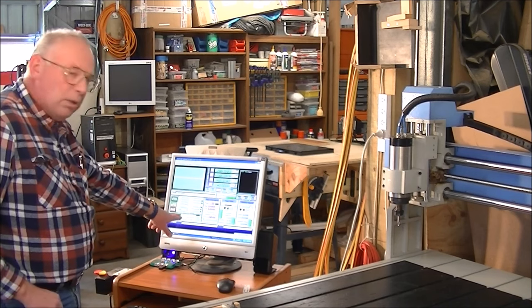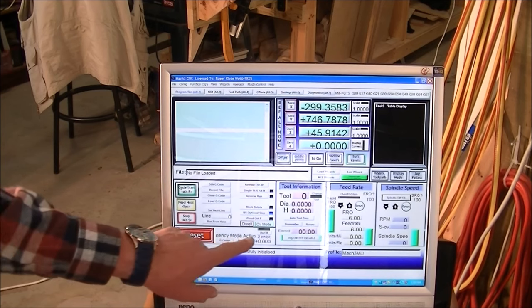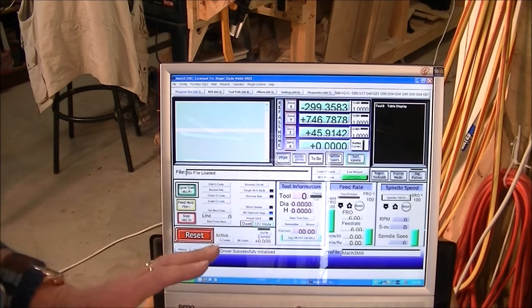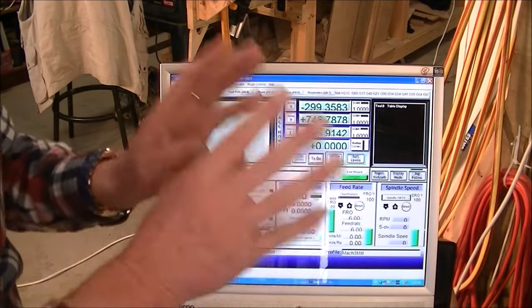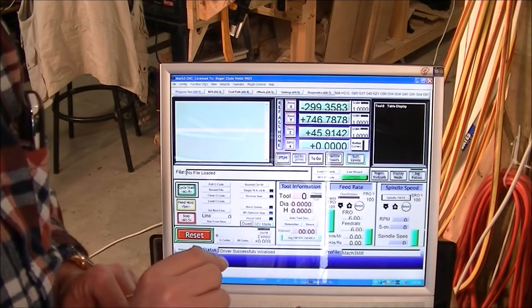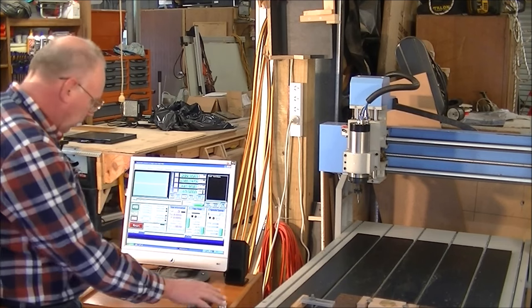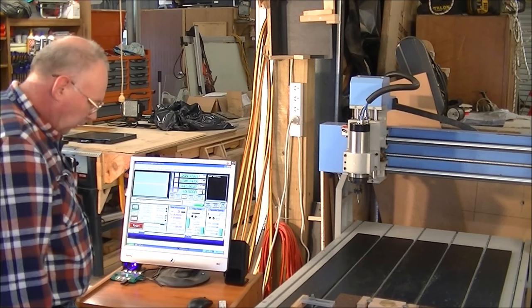Make sure that the reset is on — in Mach 3 you'll see a message showing 'emergency mode active.' That must be active because Mach 3 shuts any contact down from the CNC machine; the machine is not live, not giving any commands — it's shut down. That is the state you need to start your CNC machine. I have my CNC connected to a dead man switch on the side of the cabinet which houses the computer.